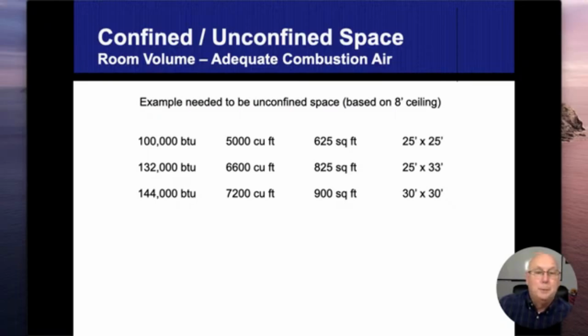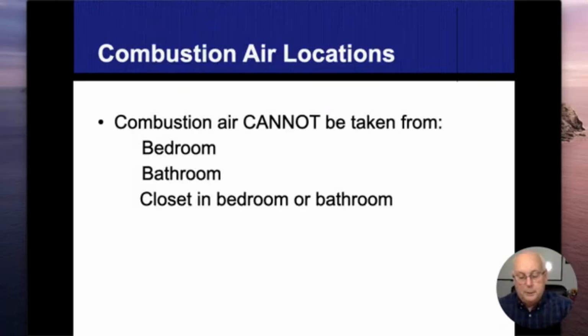And typically they wanted to have fresh air coming in from the outside. But everything's more efficient right now. We're not at that point. So if we have an open basement, even if it's finished, as long as it's wide open, then we really don't have to have any sort of external combustion air coming in. This is a golden rule. It does need to be committed to memory.